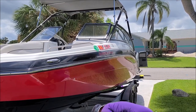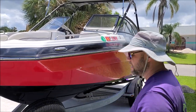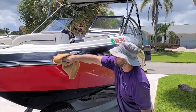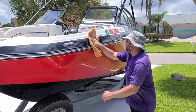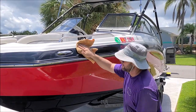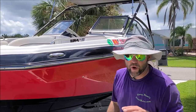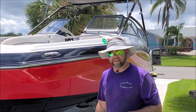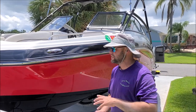And that, as they say, is that. I was running it at about 2000 RPM. And as you can see, that stuff cuts awesome. I have no problem removing P400 grit sanding scratches with the Gel Coat Oxidation Eater. It cuts really, really well, but it finishes nice too.